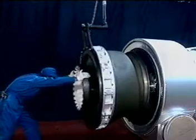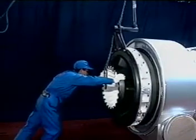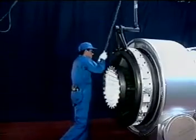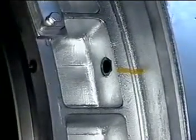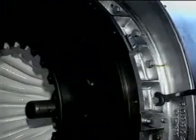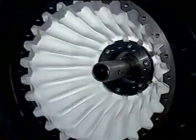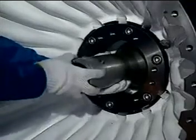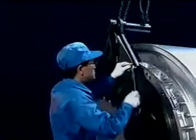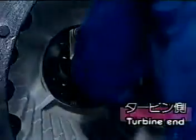Carefully insert the air inlet casing. Align the marks on the air inlet casing and the air outlet casing. Tighten all the bolts. Remove the guide piece and the centering tube. Remove the holder. Remove the axial lock and the guide plate.